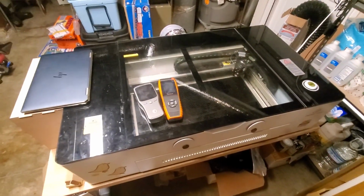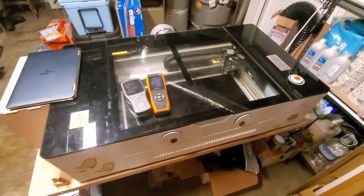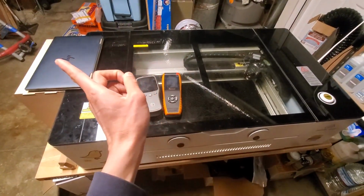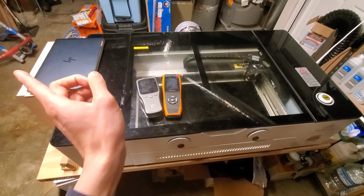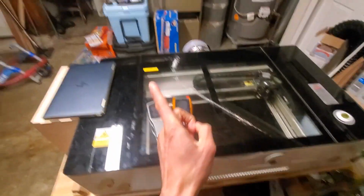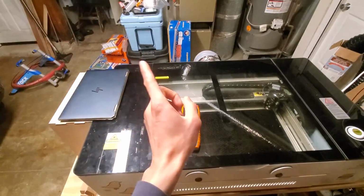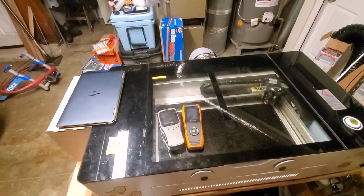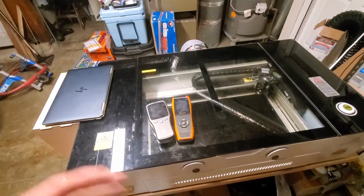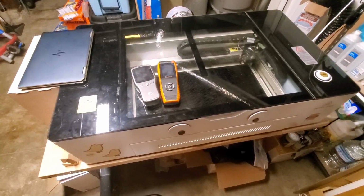In the previous video, if you scroll back to my previous videos, what I was doing wrong was that I was exiting my exhaust air through the same wall that I was intaking fresh air. I was exiting out this door on my left, and then I was intaking fresh air through that door. So they were all part of the same wall, and I was getting pretty much the exhaust air coming back into the house. That's why I was having exhaust issues in that previous video.